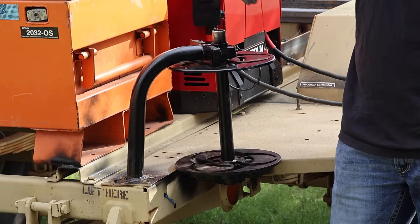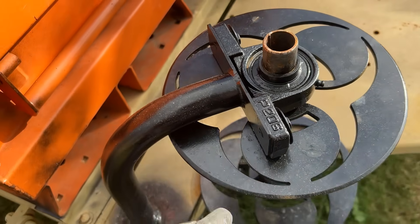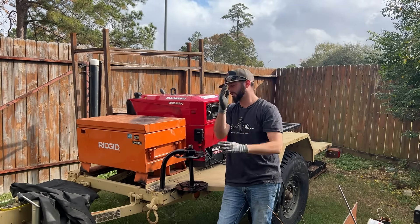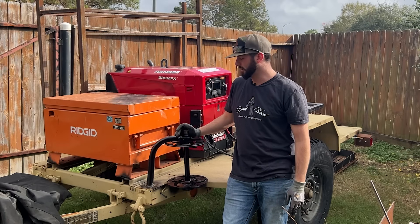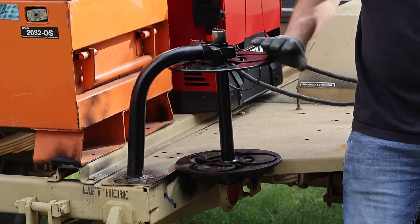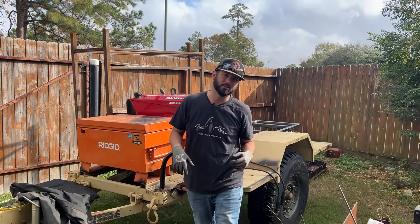This was the first prototype that I started making. While I thought the little rollers were cool and the side plates were nice and neat, the bearings were the problem. These are some different pillow block bearings. I only wanted one on a post and nothing on the other side, but with just one bearing it flopped. You have to have two. That's not really what I was looking for, along with this size pipe in the middle — it just wasn't what I needed. I'm still going to find some use out of this one, maybe making an extension cord reel. Let me show you how I solved a lot of my problems on this first build to work for what I needed.